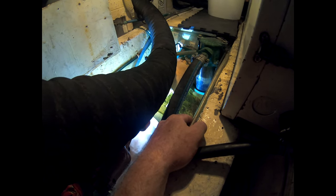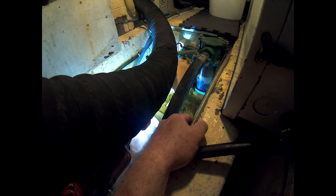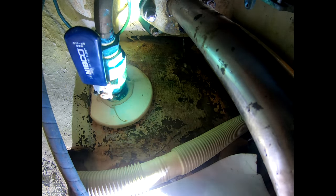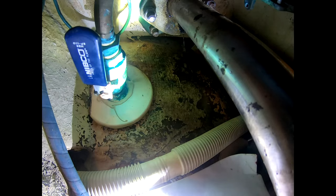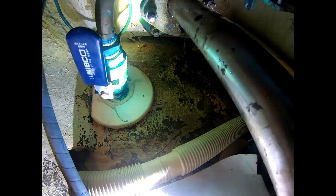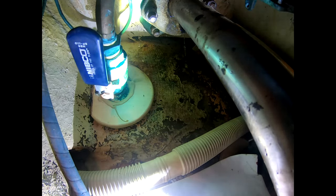That gets a little trickier — I've done it before but it's definitely trickier. See it leaking, that water right there? That shouldn't be leaking like that when I'm stopped and the shaft is not moving. There should be no leaking when it's stopped. When it is moving it should leak a little, but it's literally a drop every minute type thing.